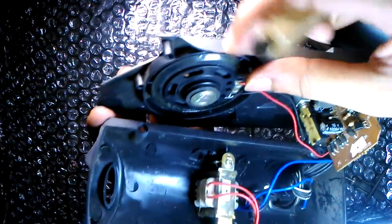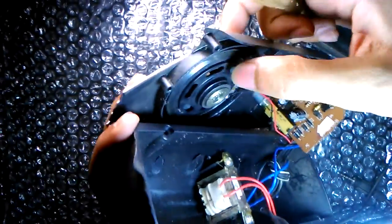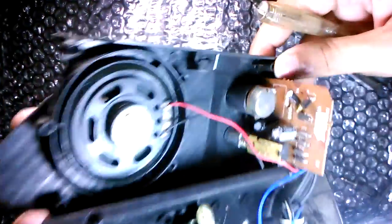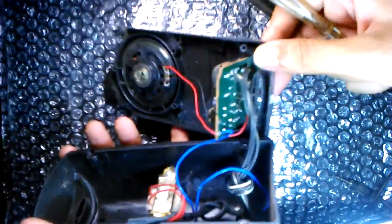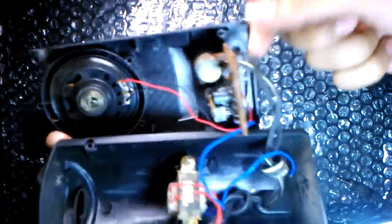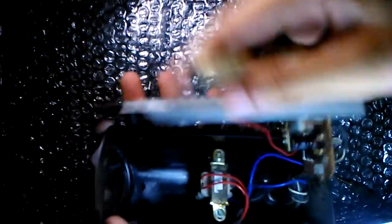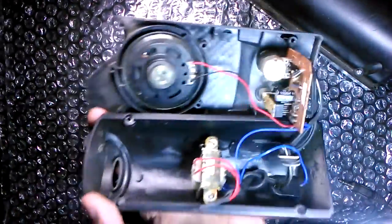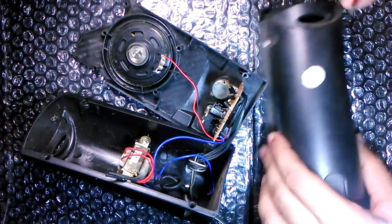At this point the speaker quality is horrible because, as you can see, the speaker is just 0.5 watts. Look at the size of the back — I think the speaker magnet will be somewhere in the one-centimeter range. One ridiculous set of speakers. There's nothing more to explain — the audio comes in straight to the input of the CE amplifier, it amplifies it, and I'm guessing you guys know how the CE amplifier works. So let's open the other one and see if there's anything special inside.